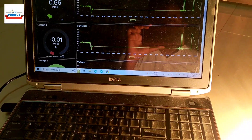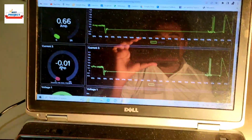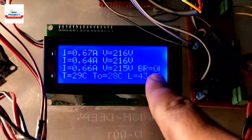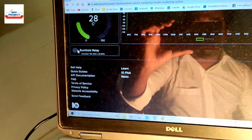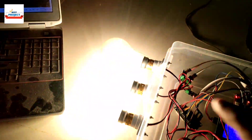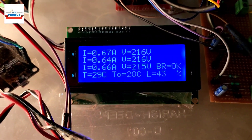The third reading is zero because that lamp is off. We turn on all three lamps. After 30 seconds we will see updated data on the LCD and IoT server. The Buchholz relay fault indicator is showing because we turned off the fault button — there is no color shown, meaning no fault. Currents on all three sensors: 0.6 ampere, 0.6 ampere, and 0.6 ampere — all three loads are on. You can also see a voltage drop occurred — current voltage is now 216 volts.